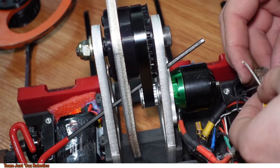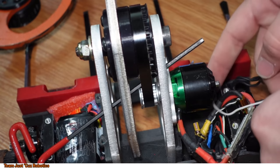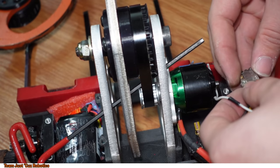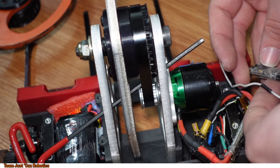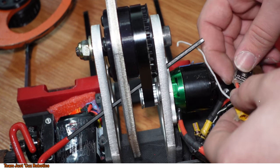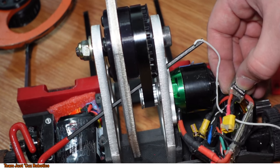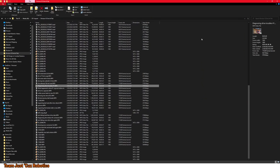Looks like it was just packed in too tight into that corner and vibrated too much or something, and that wire broke off. So yeah, I ended up having that, and then also I have to cut the insulation back and resolder it, but that's a pretty easy fix. Just has to connect to one of these pads up on the right. There's one other issue though.